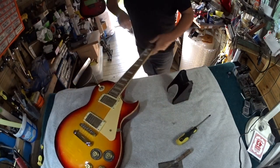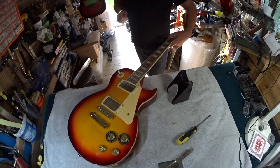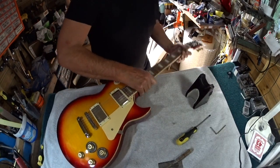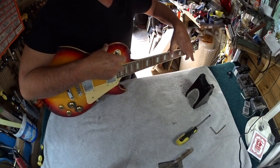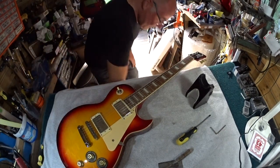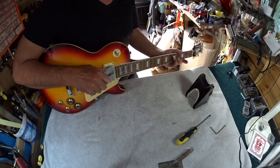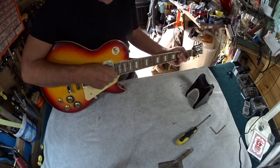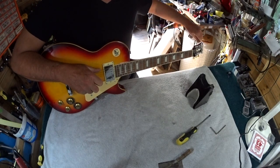They made the two components for this nut in brass, and one component was effectively a zero fret, but because it was made of brass, it notched incredibly quickly. In fact, it notched probably before the guitar even got to the owners. So that was unacceptable. It ended up with these horrible notches, and it's just a stupid mistake that brass is the worst possible material you could make a zero fret out of, because it's so soft. You need stainless steel if you're going to use metal.